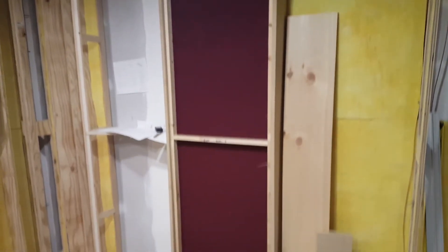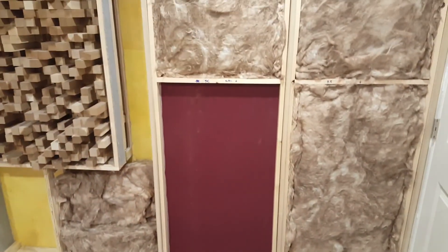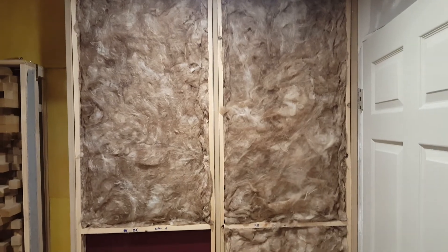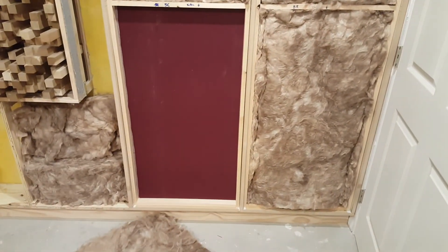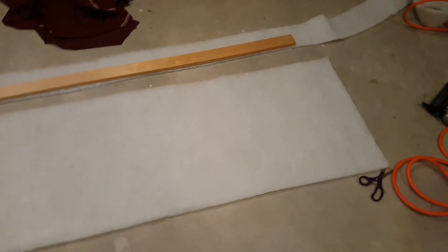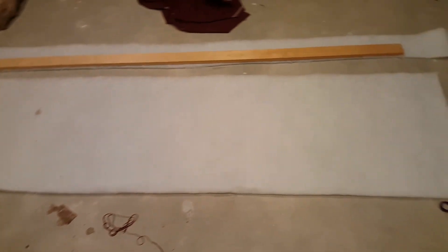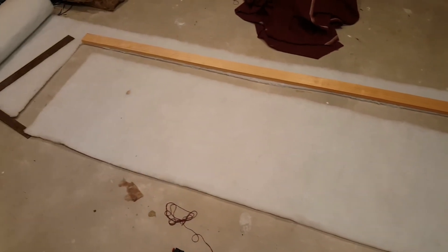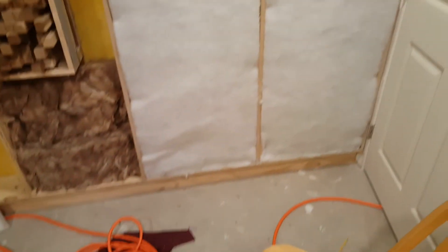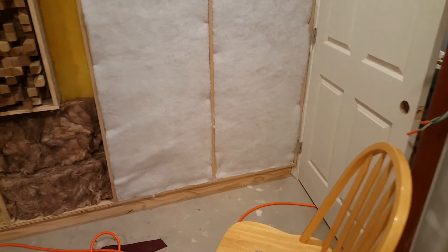It fits right in there — that protects the membrane. There's about just under three inches of space left for some broadband fluffy insulation after we get the fabric in. Just a couple of pieces of fluffy insulation split in half, so about an inch and a half to two inches right after the fabric, and then after this we'll do Dacron. The last step before the breathable outer fabric is the layer of Dacron — it's good to protect you from any fiberglass pieces that might come out of the trap. I've put Dacron in two of them already, and now I'll do this last one.